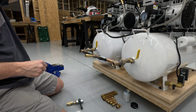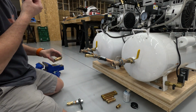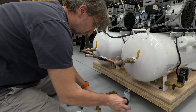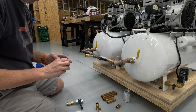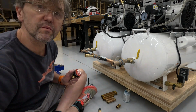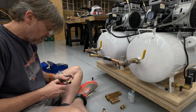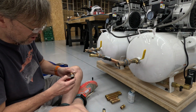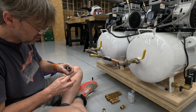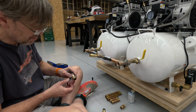Well, let's connect these ball valves so we'll be able to run them both through here or independently. So let's do that. These are the only straights I'm left with, so that's okay. I won't worry about that too terribly much. We'll put the dry stuff on all at once. And hopefully the internet's right about the choice of product. I imagine that it is. And I get the impression that putting on too much of that tape actually defeats the purpose of what you're trying to accomplish.